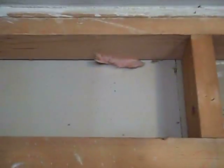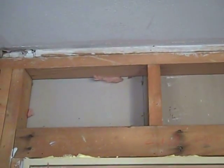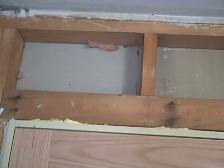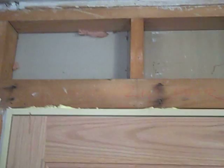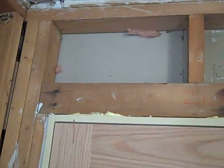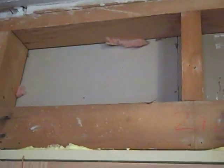All day long during the heating season, hot air is moving into that stud cavity, somewhat slowed down by the old fiberglass insulation, but it has a clear passageway up into the attic. The ways to correct this are to seal the attic — you'd take caulk or foam spray and go over every single exterior top plate as well as internal wall top plate — or this stud cavity could be dense-packed with cellulose fiber. The dense packing will under pressure move those cellulose fibers up into these cracks until they are effectively sealed.